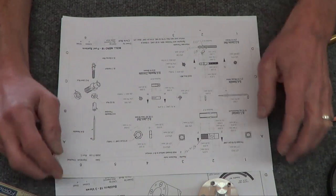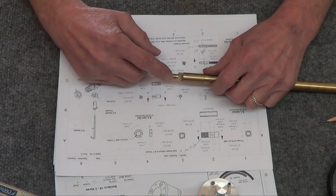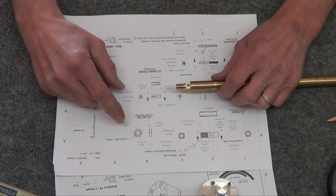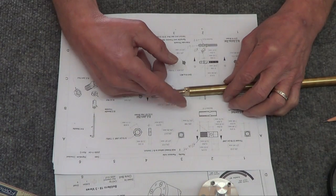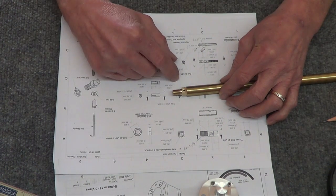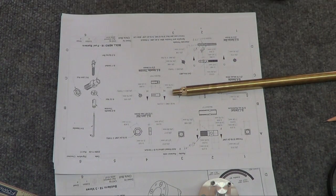The carburetor. So, a piece of 1/2-inch brass rod goes in the lathe, turned down to 5/16 and threaded, 5/16-24. It goes into a collet block square in the mill, machine off 4 sides here, drill through for a 6-32, tap it all the way through, flip it over, drill the threads out on the other side, which wound up being a .144 drill bit.